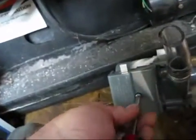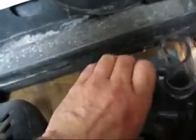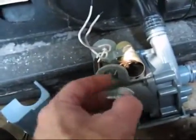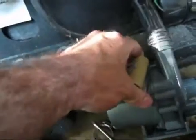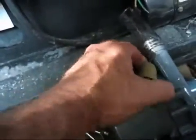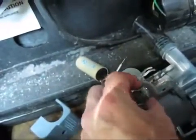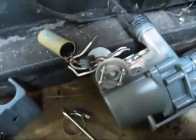There's a Phillips bit right here, and you just turn it clockwise and pull the little cap right off. It's hard to do while holding the camera, but that's what it looks like and you've got your two wires inside there. We're going to install this — you can see that the hole is oblong with a little cut in it, and this connector does too. So we stick that through there like this, then put a pair of pliers on it and turn it. That's how you do that.